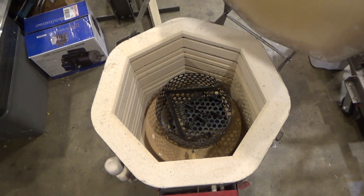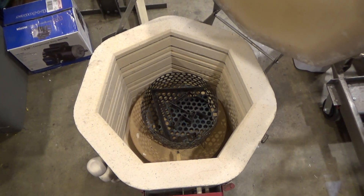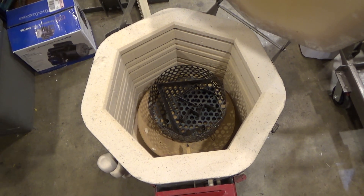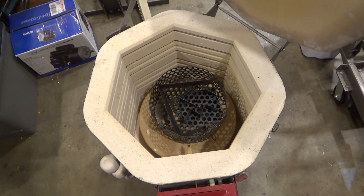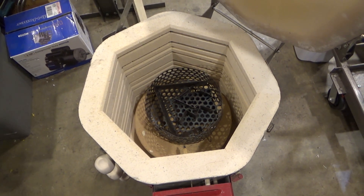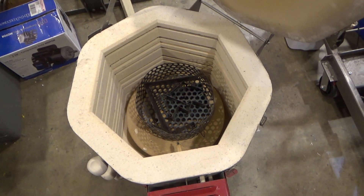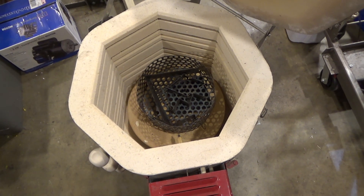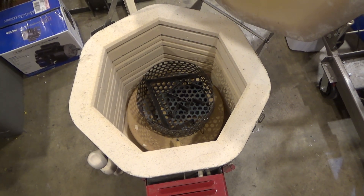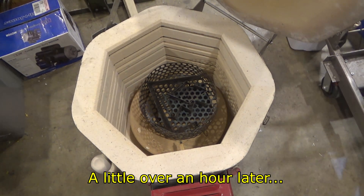The parts are going in for the second part of the hardening process. Unlike normal metals like tool steels that are tempered — where you're trying to lock a crystal structure in place — this 17-7 stainless wants to be precipitation hardened. What you do is heat it up to a temperature where the carbides and some other metals, I think copper is one of them, precipitate out of solution into little nodules, and that's what gives it its strength and resiliency.